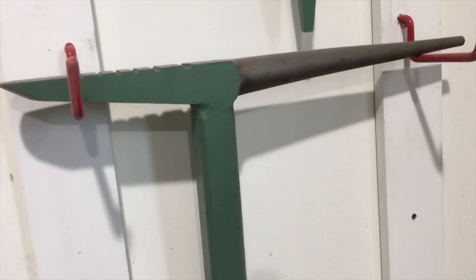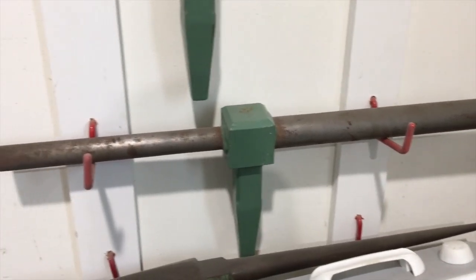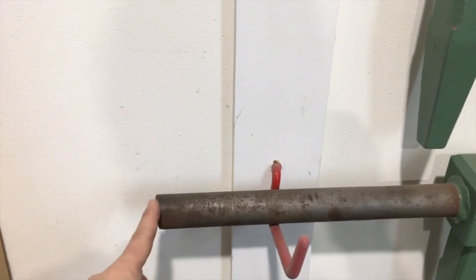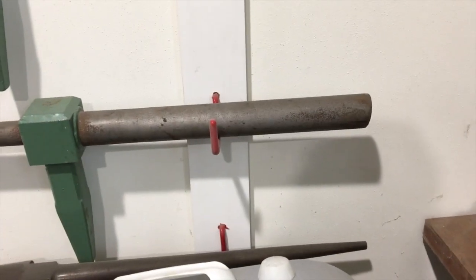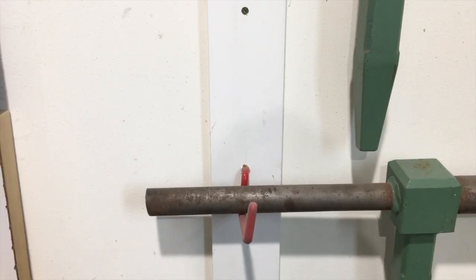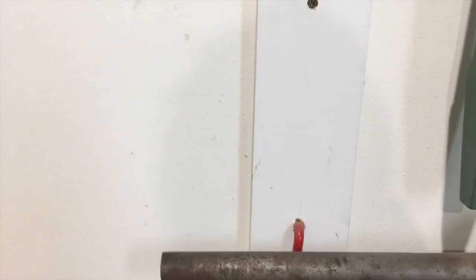I don't know why this one is called the conductor stake, but it is. Bob and I use it a lot of times to prepare burrs if the burring machine didn't do its job. Both of the ends are slightly at an angle — very slight, but that's something to be cognizant of. If you're using it, you can't really hold something completely perpendicular.